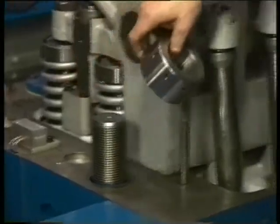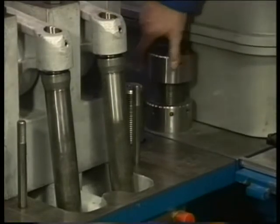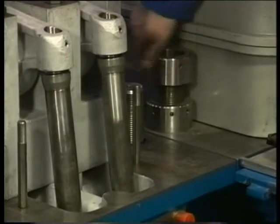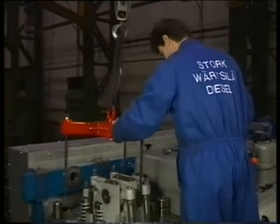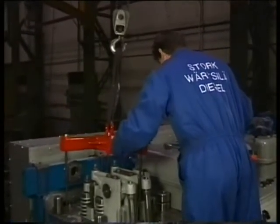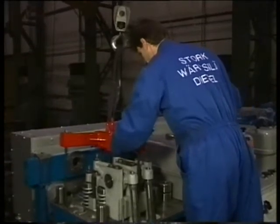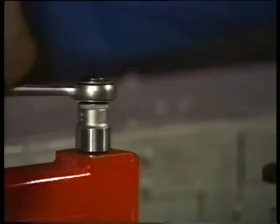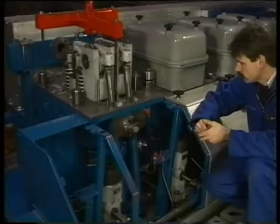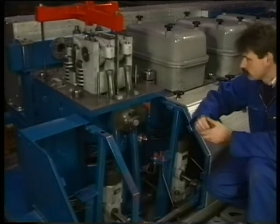In order to prevent damaging of the removed cylinder head nuts, it is recommended to turn them on the studs of the nearest cylinder head. Subsequently, place the special lifting tool. For this purpose, three M16 threaded holes are provided in the cylinder head. Lift the cylinder head a bit so that any possible leaking water will flow to the outside of the cylinder liner.